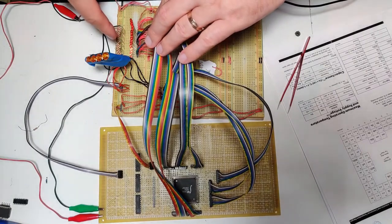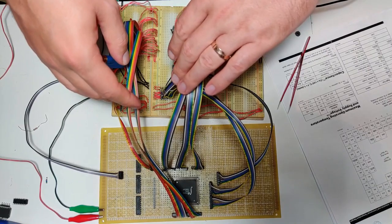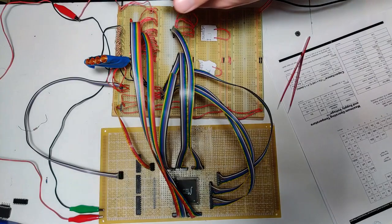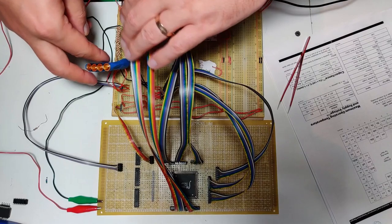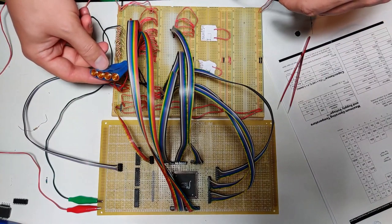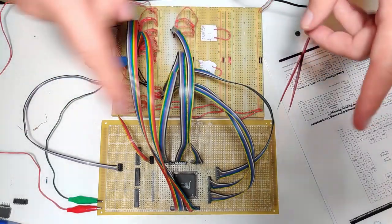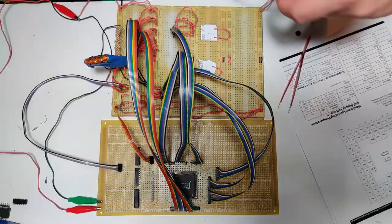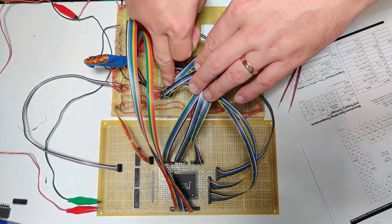As you can see, there are a ton of LEDs here. That's the data bus for the CPU data that I'm going to send into the chip. So this will be simulating the CPU writing into video memory, setting some pixels and whatnot. And this, of course, represents what is ultimately being sent to the VGA output going to the monitor. This is the pixel. I messed up, which I'll get to in a minute, and maybe you will have noticed before, but there is some trouble here. But anyway, these are the address lines.